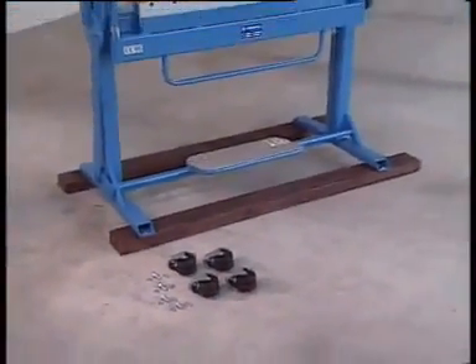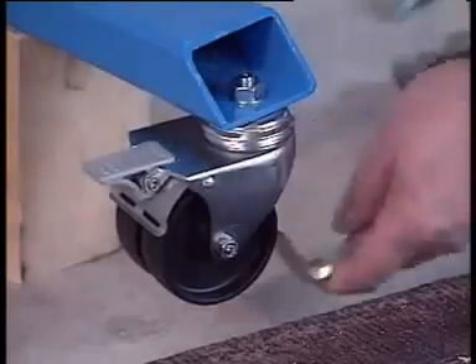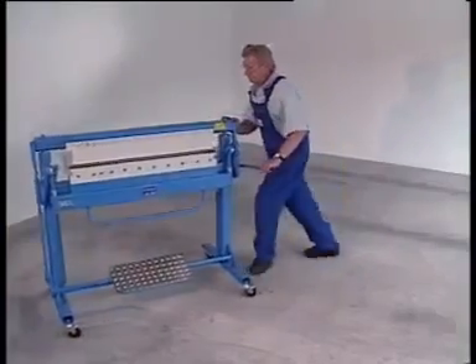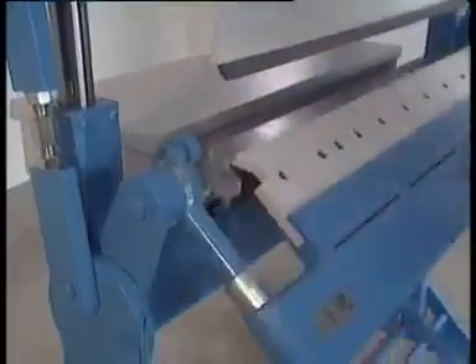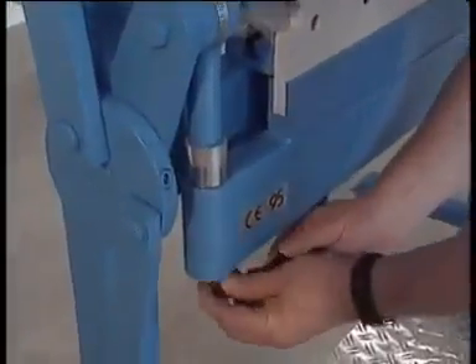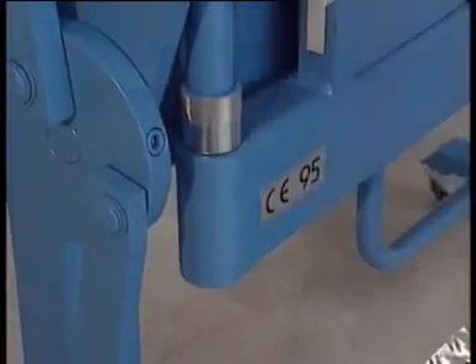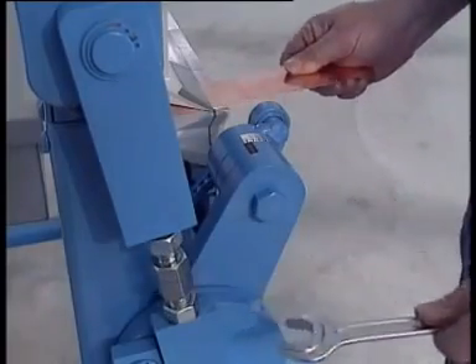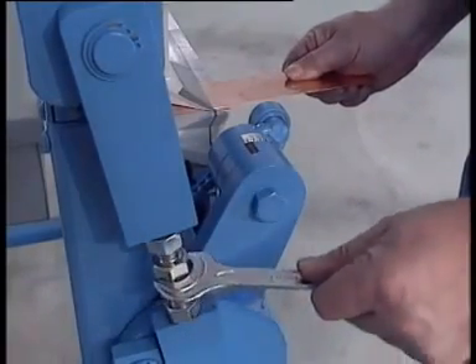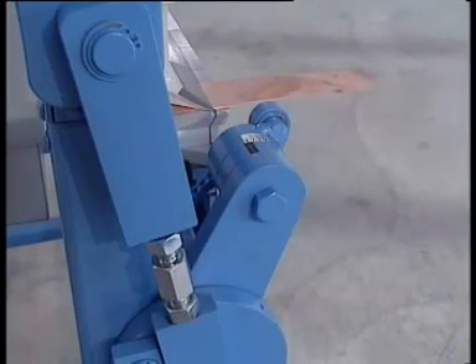Castors are also part of the UK standard equipment and can be mounted on the side frames. You can roll your universal bending machine to its working site without any problem and then roll it back to its small storage space. The machine is equipped with maintenance-free bearings. The bending beam can be lowered to adapt to different metal thicknesses. Clamping pressure can be adjusted by a screw on the upper beam to meet demands, but the basic adjustment fits almost all usual materials and metal widths.